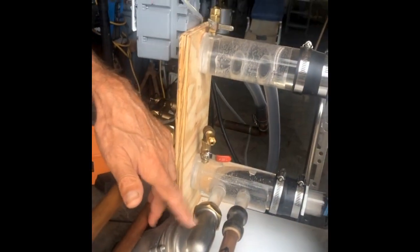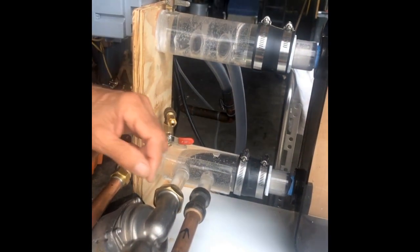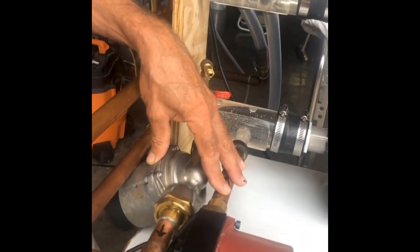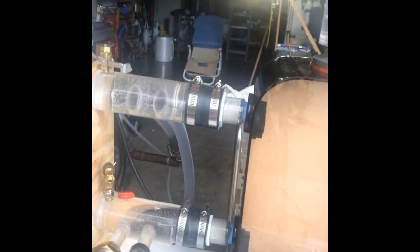What I have here is the boiler pump, and I'm going to pump out of the bottom of the tank — out of the bottom of the header — and back up to the upper one. The other pump, let's call that my distribution pump. I'm going to push into the bottom and push hot water out to my distribution. I've got both pumps set at the exact same flow rate, within a tenth of a gallon. What should happen is when I inject some red dye, you should see that flow going through these two headers with no or very little interaction with the tank.